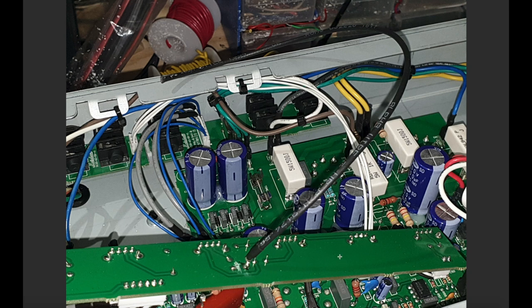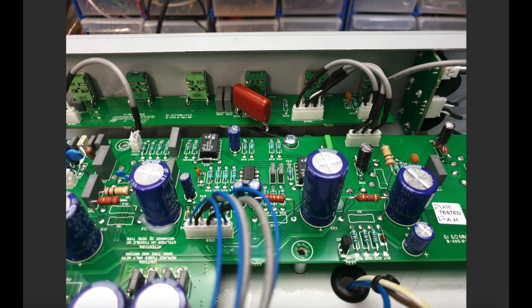Before you put this PCB away or remount it, I've got the signal wire of the coax soldered into that pad there, underneath the board. I've used some heat shrink just to get rid of the shield, because I'm going to ground it on the other side of the coax. The reason we ground it, of course, is to protect the signal from any noise. Here you can see, now that the PCB is back in, it's reasonably tidy. There's the cap, there's the 10K resistor, mounted in there and pretty secure. I didn't have to change any of this, so all of your headers and plugs and so on just work without any change.